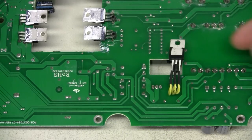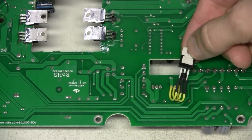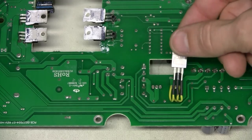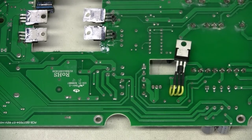I am going to physically decouple these devices from the board. This is a compromise — the wires should not be too long and too thin, because it's a high current circuit. On the other hand, thick and short wires would be too rigid, which would defeat the purpose. I think something like this should work fine.